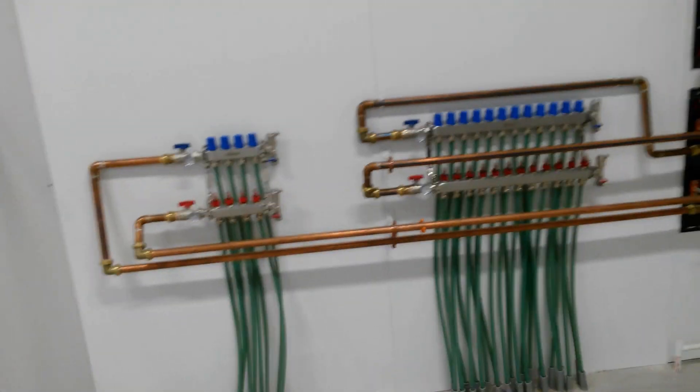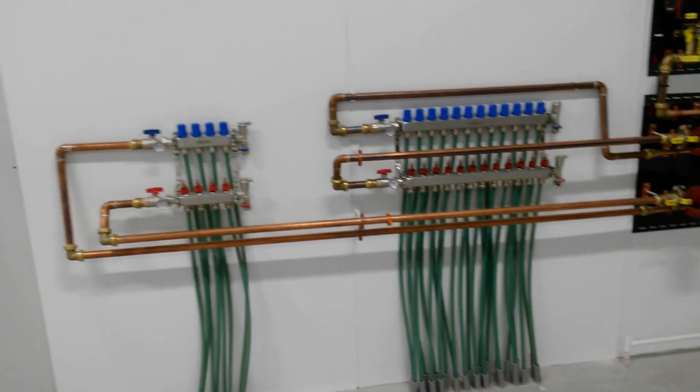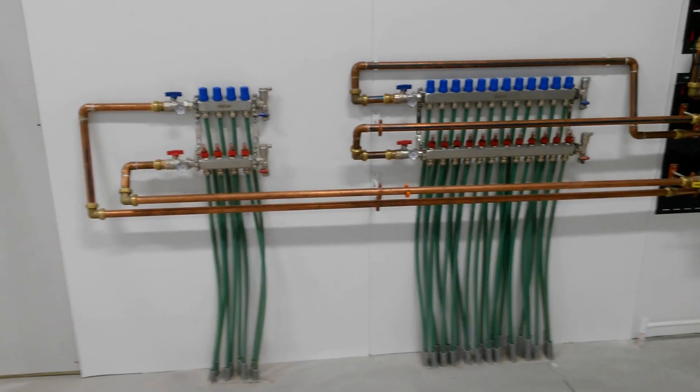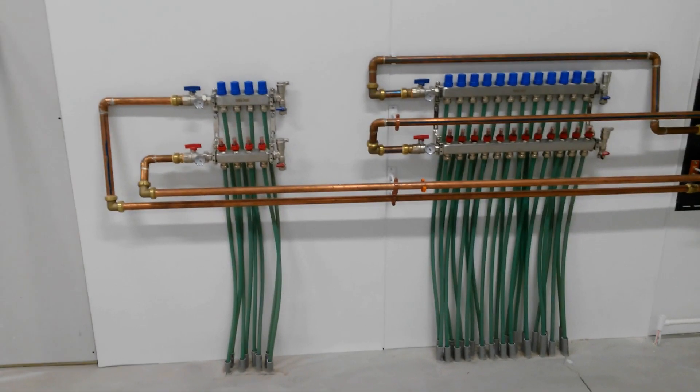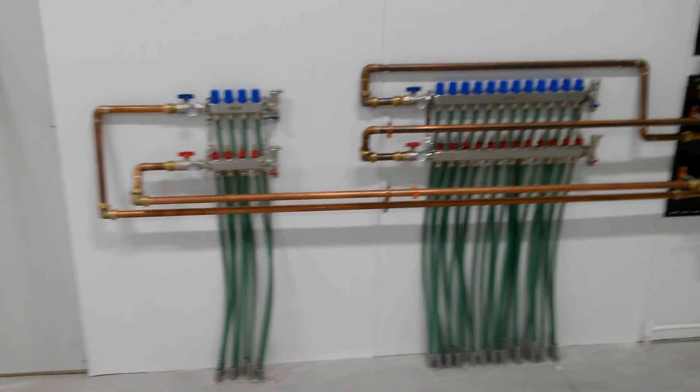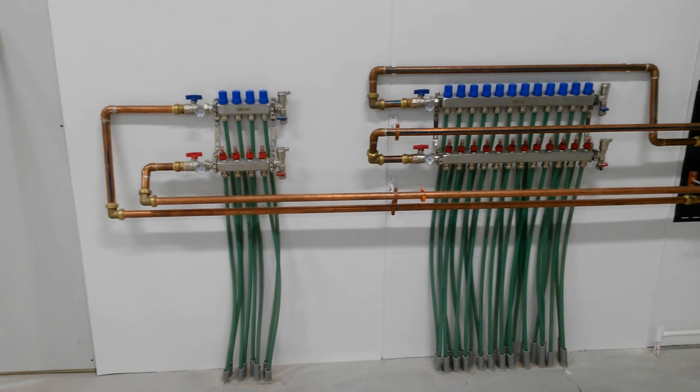Hopefully this helps you out — yes, tankless water heaters can work. This building is 3,200 square feet and I'm running 4,700 feet of tube in, since this is a thermal mass. So if my building can do that, if you're running less than 4,700 feet of tube, then your system should be able to do it.